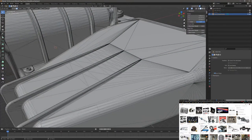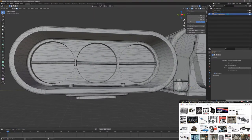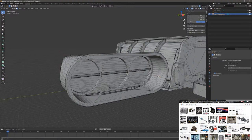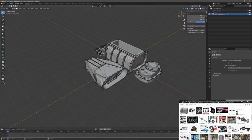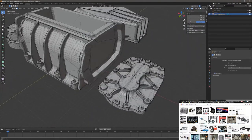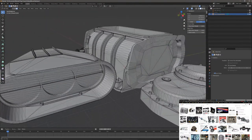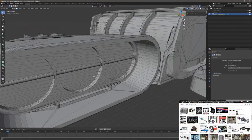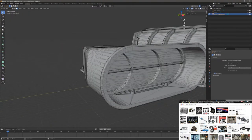I'm thinking I might leave it that way, because I kind of like the way those layer lines look when it prints. It looks like it's supposed to be that way. But the butterfly isn't printing very well, so I might change the orientation of this and make it an insert so that it's a separate part, kind of like I did with the faces of these. I took these off and made them a separate part so that they could be oriented up so that they would print better. And they do print really nicely now. So I might do that with this too, but that's not what I'm working on right now. Yeah, Dominic, I think that's what I'm going to do. I think I'm going to make it an insert. I like the way that sounds, so I'm going to probably do that.